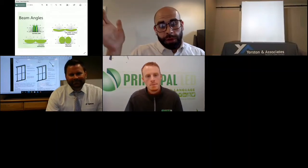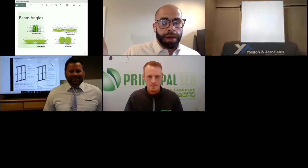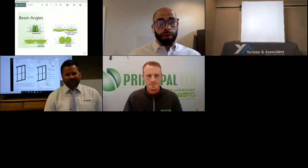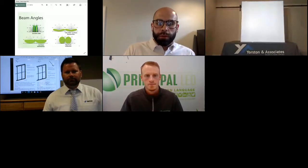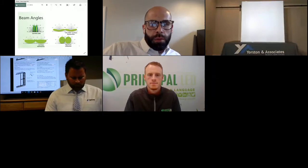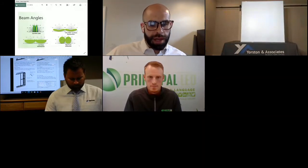Okay, so I wanted to chime in a little bit. I tried to, but I was muted. What Jordan is describing is exactly what's happening with the cabinet we have on the screen right now. However, if you're not taking advantage of the extended frame brace that Jeremy was talking about, or if you're retrofitting the lighting in a cabinet in the field that previously did not, depending on the depth, what can happen is, if I double click on Lauren's screen, if everybody with me will as well, you look where it says ultra wide low dome bat wing optic. Depending on the module, you see where the light's all the way going to the side. Where that apex point is is somewhere in the range of about 4 to 6 inches with most of the products we have in the principal lineup.